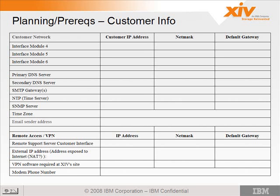You might want to know that, internally to the system, this is an external NTP server to get the time to sync with the customer's time. But internally, the systems all share an NTP server between themselves, so they're all synchronized internally. So you don't have to worry about logs from one module having a different timestamp from logs from another module. The modules even act as an NTP server to other components such as the UPS, so the UPS timestamp also matches the module's timestamps.